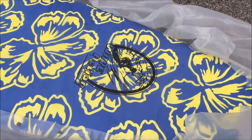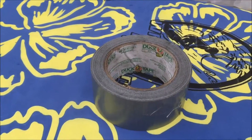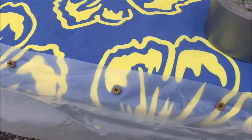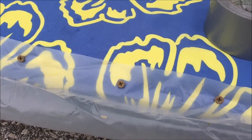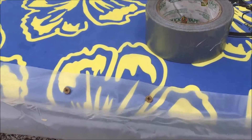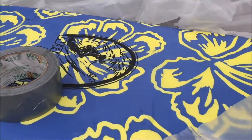Okay, now you can see all the screws are on for the skirt. However, between each screw there's a gap where air can escape. That's where the duct tape comes in, and you can do it little piece by little piece, or you can try and do big long sections — it doesn't really matter. I do them in about seven inch to foot long sections; it seems to make it easier going around the corners. You want to make sure you get a really good seal, and you can use two or three layers of duct tape if you want to — it just depends on how much you have.